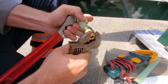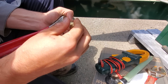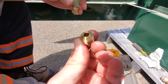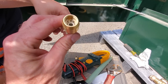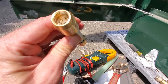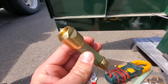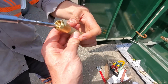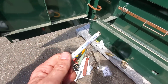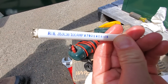You're going to want to remove that cap. We can see on the cap here — the tip is kind of tapered. We'll get into why that is in a minute, but as it seats the fuse, it spreads those ears to make a good connection against the brass. If the fuse is blown it's a little bit easier to remove, but we're just going to take a small screwdriver and pop that guy out.